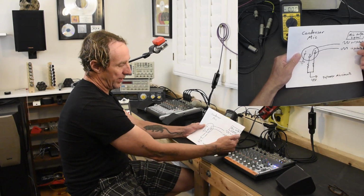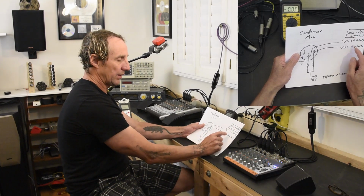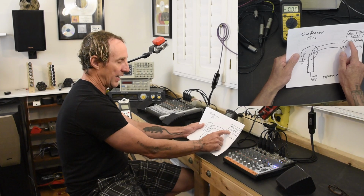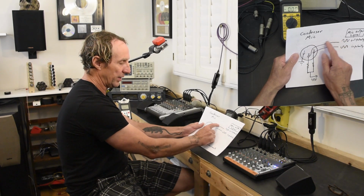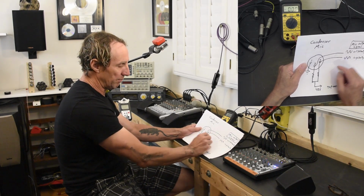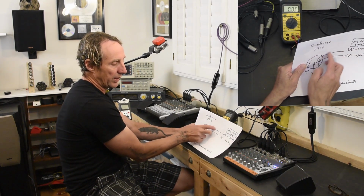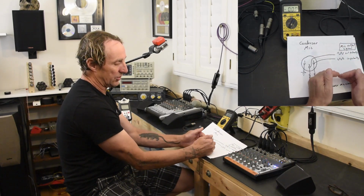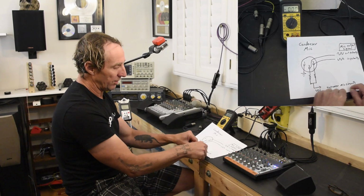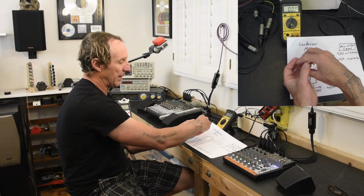Additionally, there is the output of the microphone, the signal, and you have the in-polarity signal, which shows up on pin 2 on a properly wired mic. You have the out-of-polarity signal that shows up on pin 3. And there will be a capacitor or something that blocks the 48 volts from going this way. And so this circuitry here is powered by the 48 and the ground and then outputs the signal and sends that back down the other way.